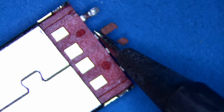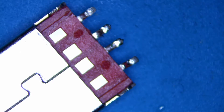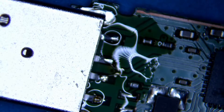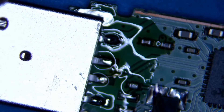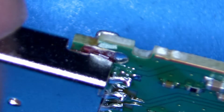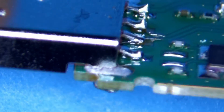We can't actually just put on the USB just yet because this is ripped off from the board and we need to remove those trace lines so we have a nice connection. We use a little bit of solder and make sure each of these four pins are actually going to be nice. We want to start with the top and the bottom one because that is the strongest part of where the pads are going to hold. You can just reconnect it — see how nice and sturdy it is now. Then we make the nice little delicate connection with our jumpers on the two middle ones. This is very delicate because it's easy to damage. You want to make sure you hold it the right way. Our solder looks pretty good — it should connect totally fine. Hopefully no other issues. Let's go ahead and test it out.